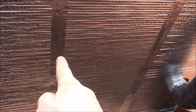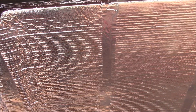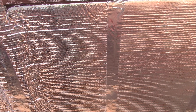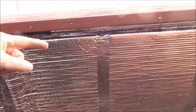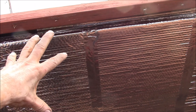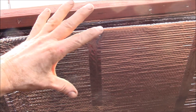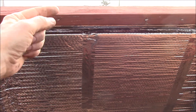We get a lot of wind from the north blowing in from this direction. A cold wind on the backside of the panels pulls heat away from the front south-facing side. So this is mainly to keep the wind from stealing too much heat. On a cold sunny windy day this should really help. Around here the wind tends to pick up in the afternoon, which is also the peak heating time — but that's also when you lose the most heat to the wind hitting the backs.